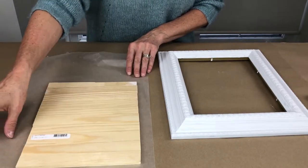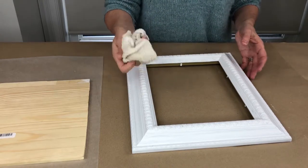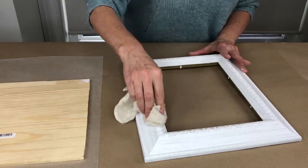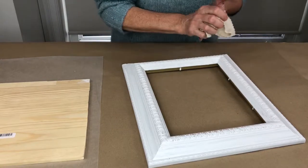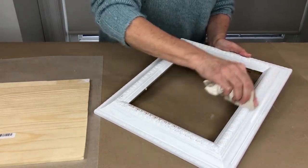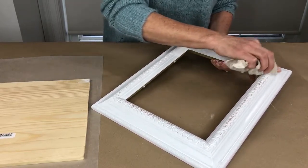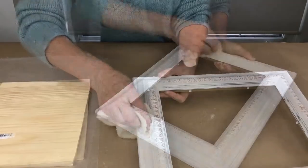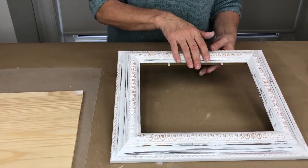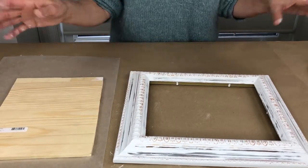While I'm waiting for the wood to dry, I'm going to push it to the side and take the frame. Instead of dry sanding with sandpaper, I'm just going to do a wet sand with a little damp rag and wipe the high parts off to get a little bit of the detail of the frame coming through. It's nice doing this wet sand because it's not as dusty and I can do it here in my work room instead of going to the garage where it's still a little cold. Now that I've finished wet sanding, I'm happy with how the frame is looking. I'm going to wait for the wood slats to dry a bit more and then we'll start finishing the sign up and putting it together.